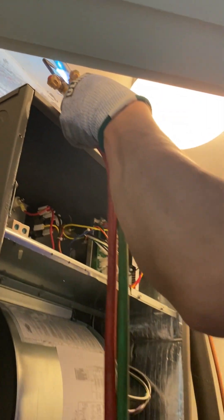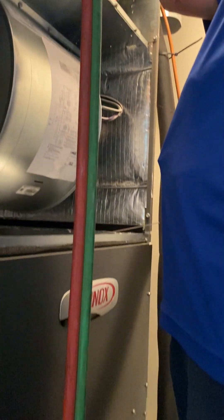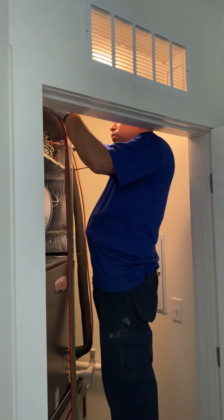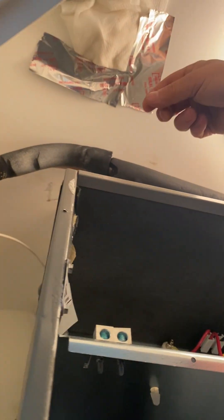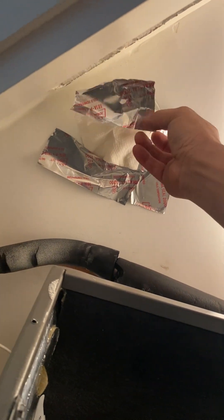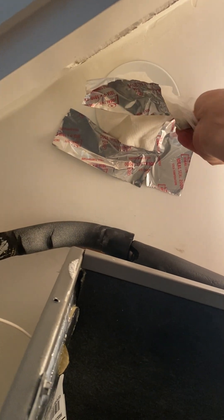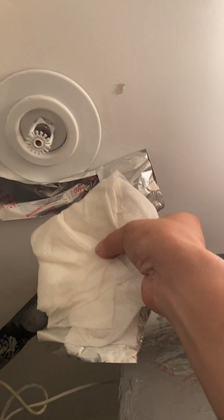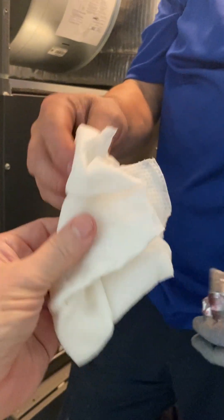He's busy brazing the inside — the smoke alarms just went off, so it's tricky to do that in a high-rise like this. Based on hard-won experience, Elia pointed out that if you're going to do brazing close to one of these detectors, you definitely want to protect it — it has to be wet. All right, we're all brazed up and looking good.